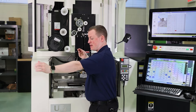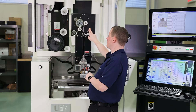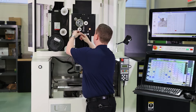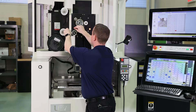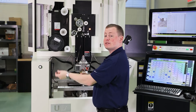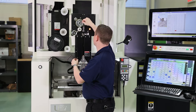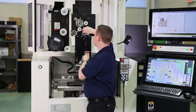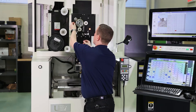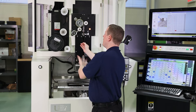Get your left hand holding the wire, then we're going to open up these rollers to get the wire through by activating this button here — you can see the rollers split apart. Go around this spring-loaded roller, and rather than rolling the wire around it, I like to take the end and go through the plastic piece first, then down through this second plastic piece. That way I can pull from this end and guide with my left hand to go around the rollers, keeping a little bit of tension on the wire with my right hand.